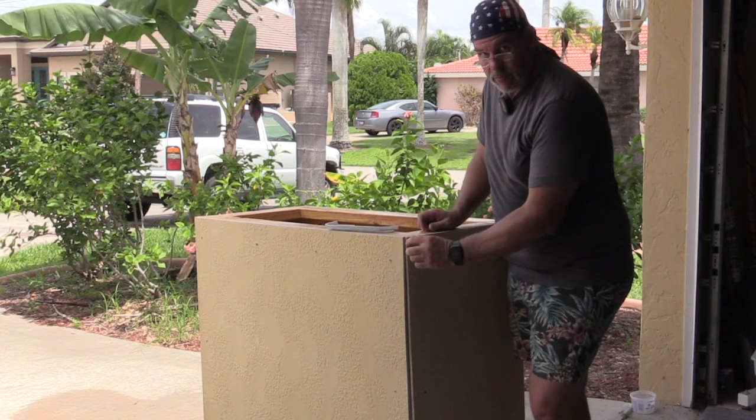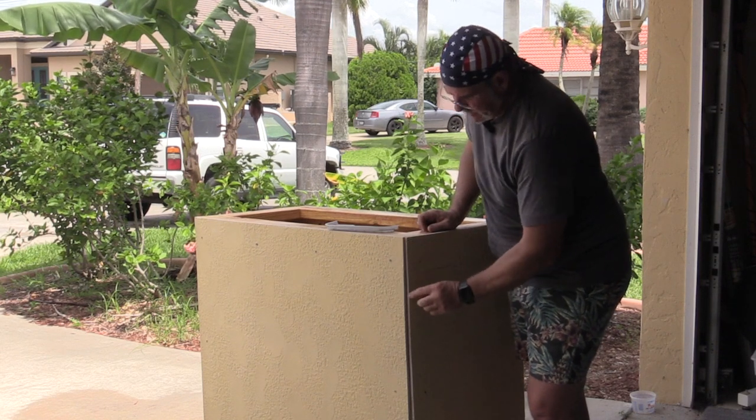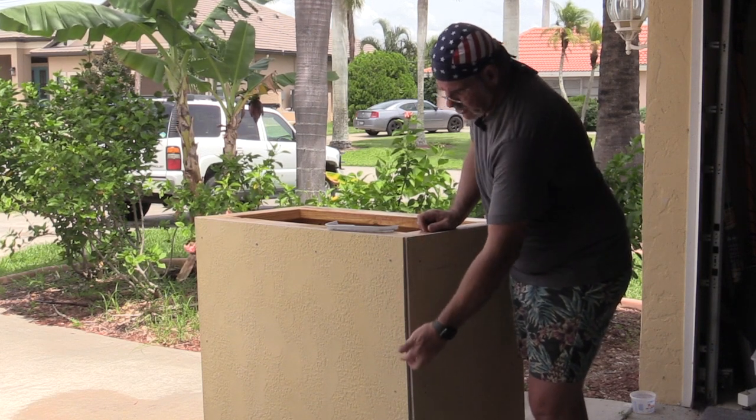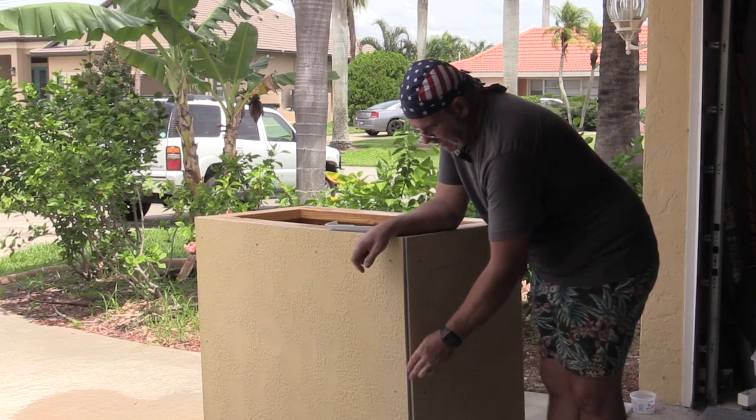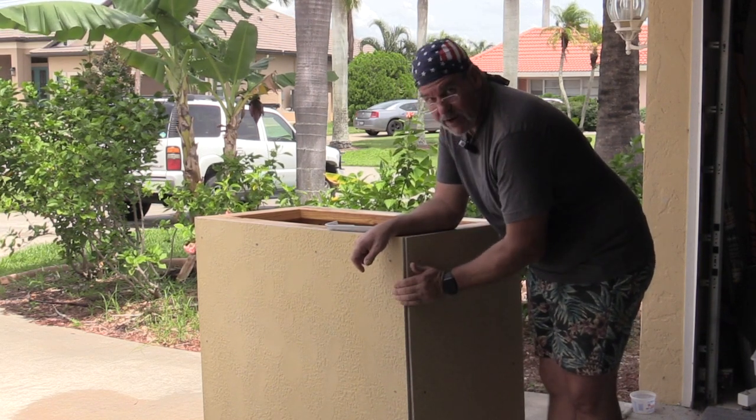And to protect myself from a lot of sanding, I'm gonna put some blue painter's tape right down the side of each of these. So as I scrape that thickened epoxy up, it just pushes right inside of that gap only, and it creates this nice little rounded edge.